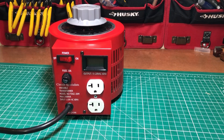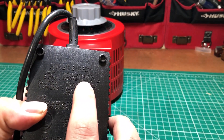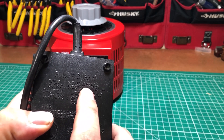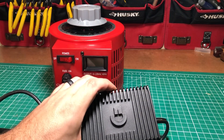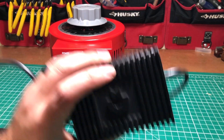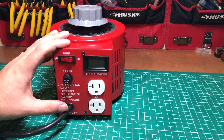If you made it this far in the video, I really appreciate it. One of the reasons why I want something like this is when you get old electronics like this Commodore — you'll see that a lot of times the power bricks are AC, and this one uses nine volts AC. Some of them like the old Nintendo you could just put nine volt DC in there, but not on this one — you actually need nine volt AC. I have all sorts of old things that I work on that need various AC voltages for testing. A lot of times these old bricks go out of spec and start putting out a higher voltage, which damages the machines. Having a variac gives you rock solid voltage for the things that you're doing.